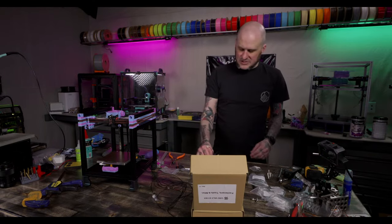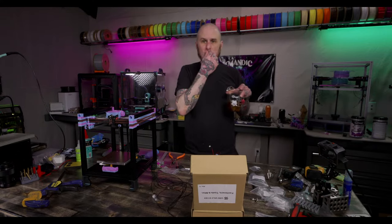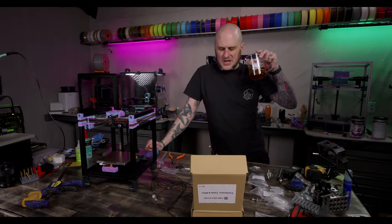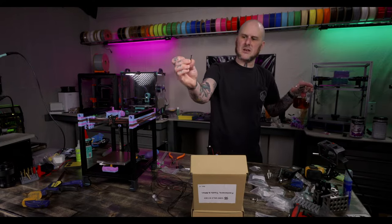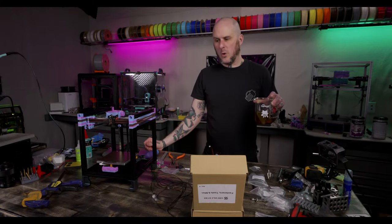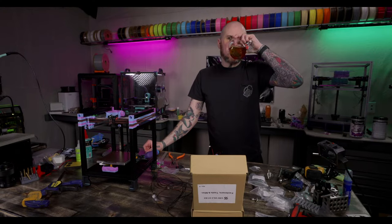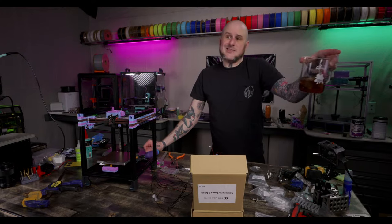Do you know how much weight you're saving per machine? No idea. I'm definitely going to weigh out the hardware and figure it out. There's also recently an issue with Amazon. There's dumb things, like button head screws weigh less than socket heads. So just switching all of your hardware that was socket head to button head, if it fits, you can save weight that way.